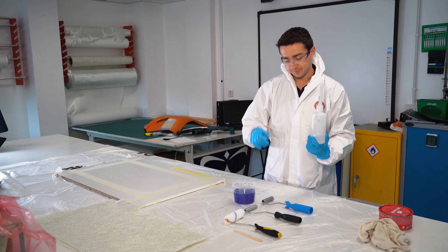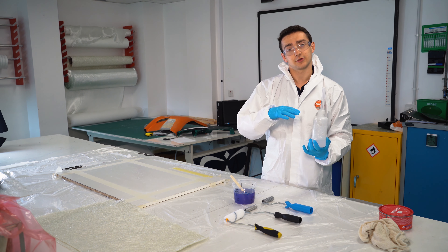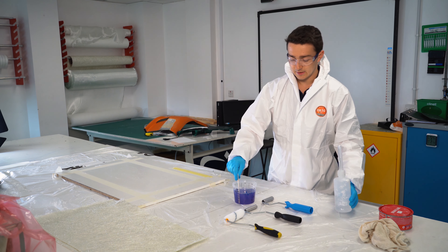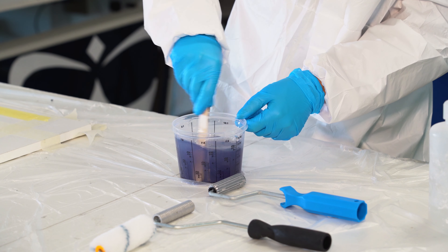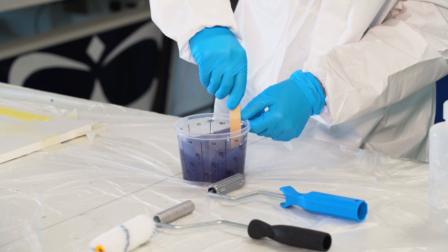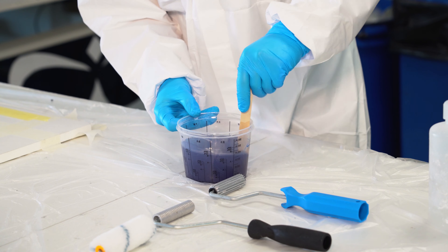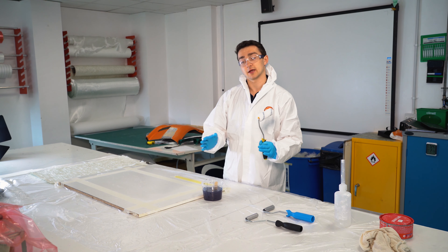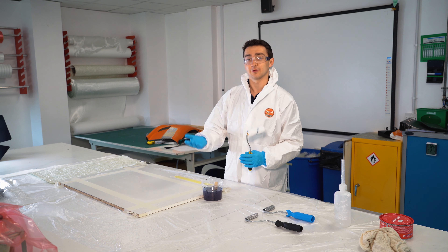We now have roughly about 8 millilitres of catalyst. Before mixing, you want to make sure that your mixing stick gets covered in the resin — this is going to ensure an even distribution and even mixing of the actual catalyst itself. Once ready, pour that in and start mixing. Polyester resin is normally a purple or light blue colour when we use it, and as soon as we mix in catalyst you should start to notice a change in colour — it should start to go much darker, going dark brown and then followed by a dark green. Next, we want to bring our pot as close to the mould as we actually can. This is to prevent resin going absolutely everywhere, because resins and gel coats go everywhere and spatter on everything you don't want them to.